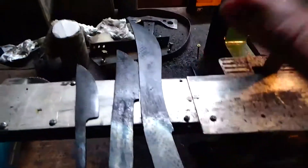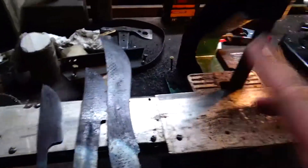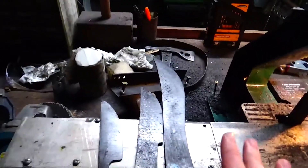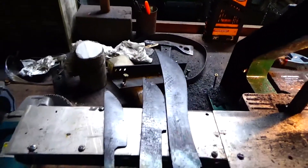How it's going to go is I'm going to sharpen these up tonight, get them to the 120 on the belt grinder, and then test them, make sure they're good, and then hand sand them, and then it's going to be handle fit-up.